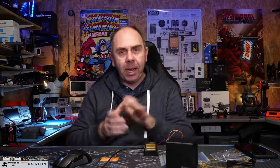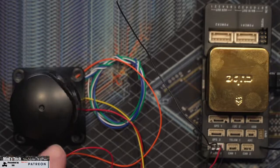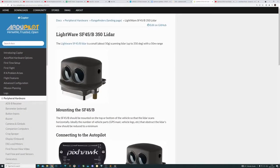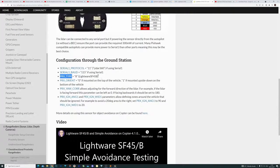To show this on ArduPilot and Mission Planner, I've got the LiDAR connected to a Cube Orange with ArduPilot installed and the LiDAR connected on UART2. You can see on the overhead that the UART is plugged into port two. To set these up you follow the instructions on the ArduPilot website - there's already a specific page for the LightWare SF-45. I've got it on serial 2, so serial 2 protocol is set to 11, serial 2 baud is 115200, and everything else is configured as required.